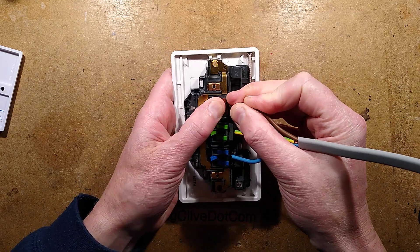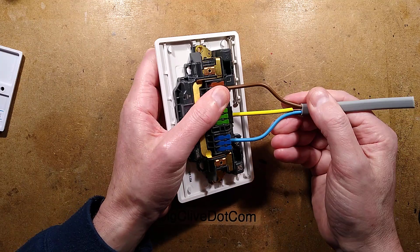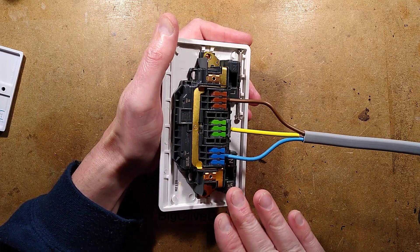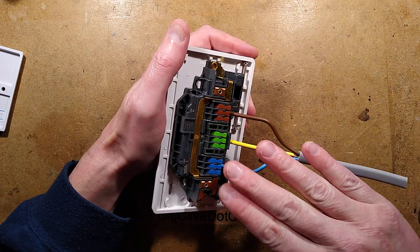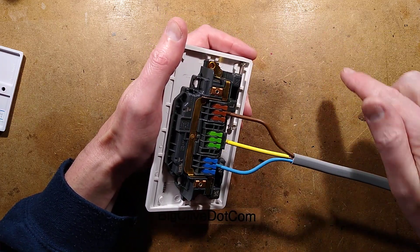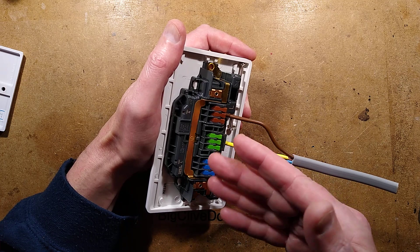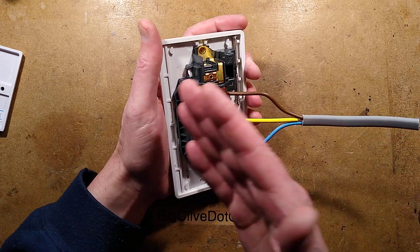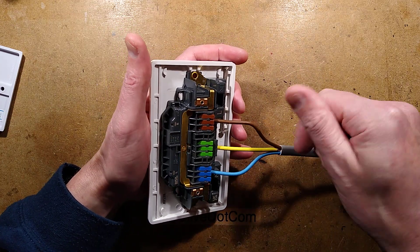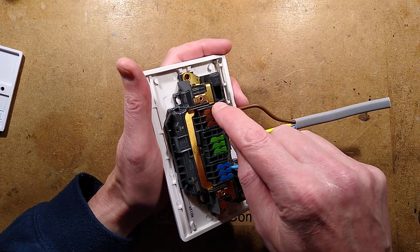Pushing each down firmly and then click the terminal over. And that is effectively a cable terminated into it. They've got three terminals to allow either radial circuits where the cable comes along, loops in, goes out, or the ring circuit as is popular in the UK — especially for these sockets — where you've got a continuous ring of cable that goes back to the distribution board so it can loop in and loop out. They've also got a third terminal to allow for spurs. Say for instance, in a kitchen you've got a row of sockets but you want to add a spur for a switched feed down to another socket for the dishwasher or whatever.